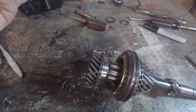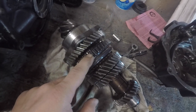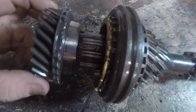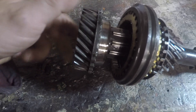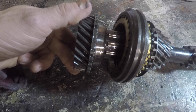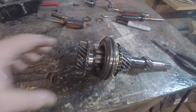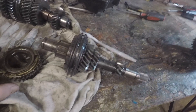Or it could be from the pinion gear, which also has some teeth missing. Obviously missing teeth are bad. I'm not sure what to do because these are actually nicely ground down — it looks like someone actually intentionally removed those missing teeth and ground them smooth.